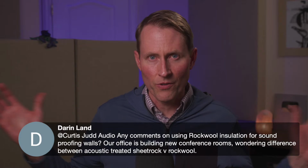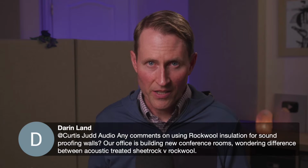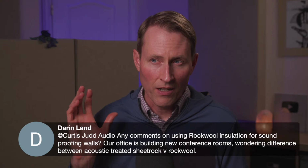In fact, if you have any question about that, go turn on a hi-fi or something with plenty of bass music playing in one room. Turn it up pretty well. Not dangerously loud, but so that you know it's really filling the room. Go to the next room over and hear which frequencies are coming through. What you're going to find is it's the low frequencies coming through. It's the bass line and the kick drum, if you're listening to popular music, that's coming through. And a lot of the high frequencies are going to be fairly well attenuated.